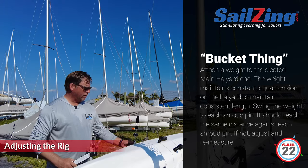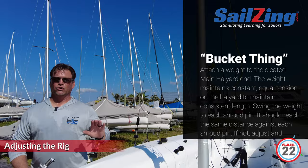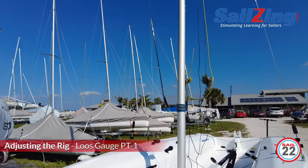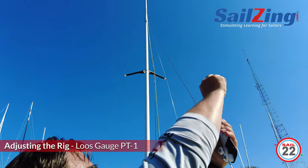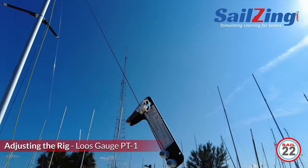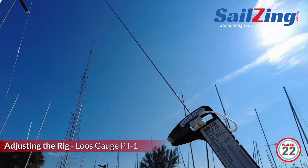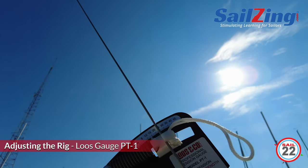So you mark it on your halyard with your bucket, and you just go side to side to make sure you're exact. This is how we do the gauge. It goes on the front, and so like now we're actually at just under 14. So I tighten that one a little bit, not crazy, but I did tighten it a little bit. So now I'll tighten this one.